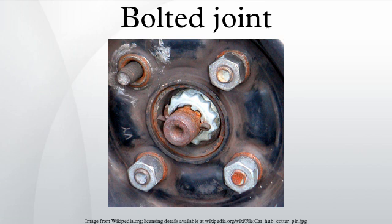Either the bolt head or the nut can be torqued. If one has a larger bearing area or coefficient of friction, it will require more torque to provide the same target preload. Fasteners should only be torqued if they are fitted in clearance holes. Torque wrenches do not give a direct measurement of the preload in the bolt. Much of the torque applied is lost overcoming friction under the torqued bolt head or nut and in the threads. The remaining 10% of the applied torque does useful work in stretching the bolt and providing the preload. As the torque is applied, it must overcome static friction under the head of the bolt or nut and in the threads; then dynamic friction prevails and the torque is distributed in a 50-40-10 manner as the bolt is tensioned.